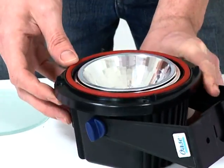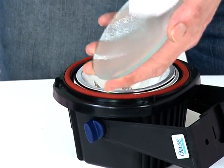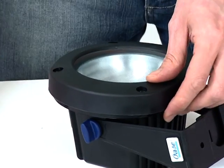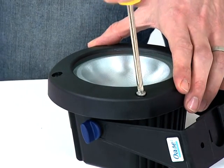If there is any sign of water ingress, the O-ring should be replaced even if no damage is apparent. To clean the lens, remove the four screws from the face of the light and remove the lens cover and lens. Clean with a soft damp cloth, dry thoroughly and replace. Replace the lens cover and screw back into place.